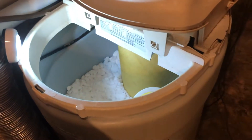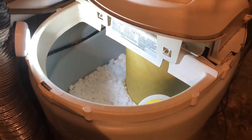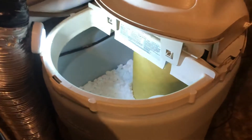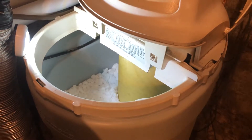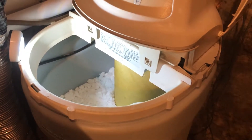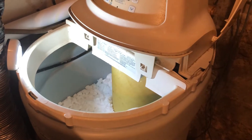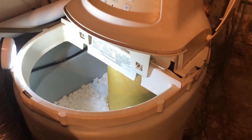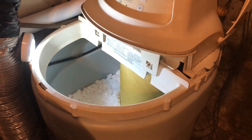I'm not going to give you all the details on how water softeners work, but there are great videos on YouTube if you'd like to know that. Basically, the salt recharges in the bottom of the water softener and makes a salt brine. There are resin beads in the brine tank that get coated with salt particles, and then it does an ion exchange — as the water comes across, the sodium particle releases and the minerals you don't want collect on the resin beads, giving you soft water.